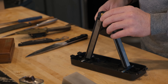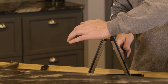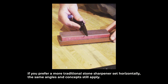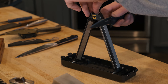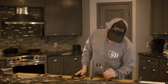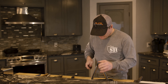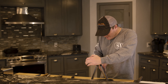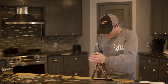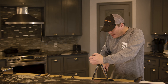You can feel where the blade is hanging up a little bit — that means I need to move more metal. If I can feel a part of the blade that's duller, I'll spend a little extra time there and even do some circular patterns keeping the blade at roughly the same angle. When that thing gets smooth running and doesn't hang up anymore, I apply less and less pressure, then I switch to the ceramic stone which is a really smooth stone that polishes and finishes it — and I keep applying less and less pressure.